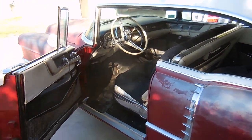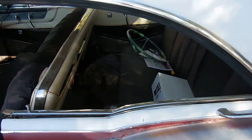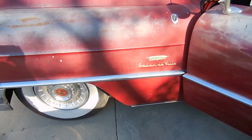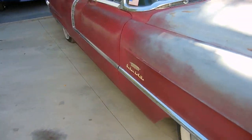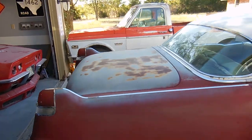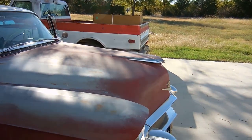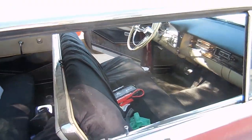I have a little bit of extra time at the end of the day, so I'll take the car out, clean the top, clean the windows, maybe get rid of all the junk I have all over the inside of the car. It's running really well. My exhaust leak came back — you can hear it — it was worth a try with the gaskets. Eventually I'm just going to have to get new manifolds or use manifolds and plane them. Something interesting — check this out — this Cadillac is pretty much as long as that pickup truck, maybe longer.